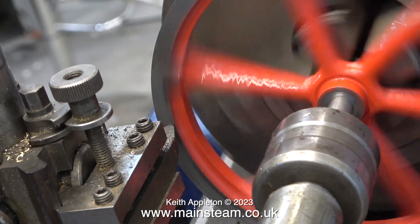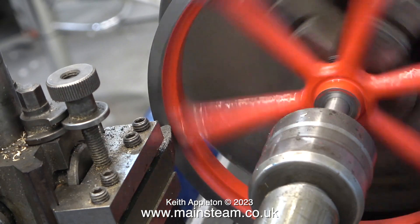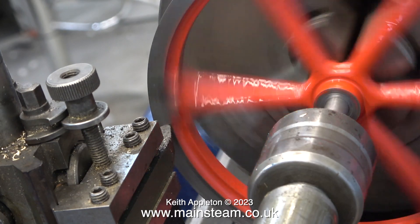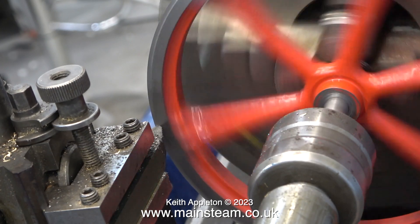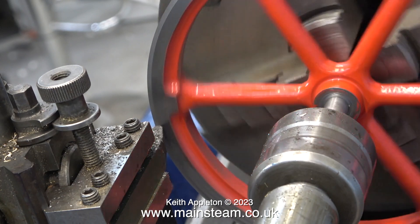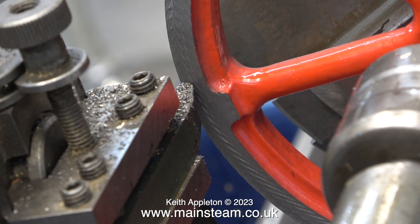In a similar way to the windmills that are dotted all over the country, their tip speeds really are fast because they are a long way from the center. As you can clearly hear, it's chattering nicely. And I would like to mention just one more time, I'm doing this on purpose. I'm more than capable of turning a flywheel without chatter. If I do that, no one's going to learn anything. So please be aware I'm not a village idiot and I am doing this on purpose.